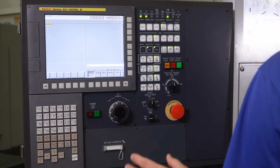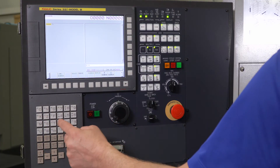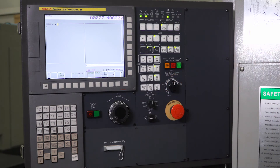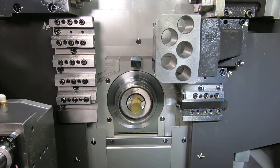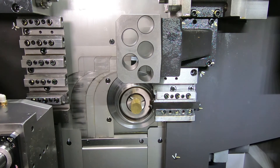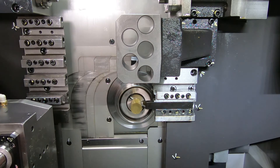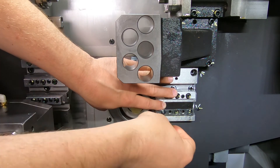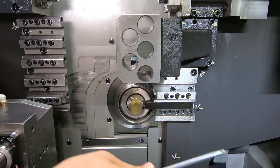I am now on center line over here. This edge should be on center with the main spindle. Then I'm going to type in X and then my stock diameter — 1.0. I'm using one-inch bar, so X 1.0, and I'm going to hit cycle start. Remember my tool is still loose in here — nothing tightened down — so I want to push the tool back as far as I can. I hit cycle start and my gang slide is going to move to a known distance and stop. I now slide my tool out to my bar. I'll use one hand to hold the tool and the other hand to tighten up just snug — all three screws. All I have to do is just snug it up.